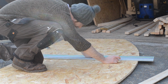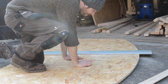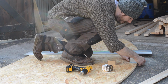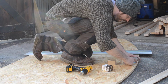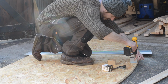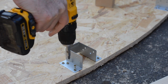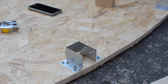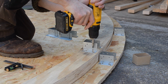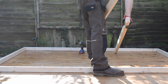I do try and think things through and work out what would be easier to do now before I actually build the walls. I decided one of those things would be to add these joist hangers while I've got everything on the floor, and it's easier to mark out where the centre point is. The first one goes on the ridge of the curve, and then I have one either side of that, evenly spaced. This then needs to be mirrored either side of my plywood curve and on the other end as well. In the next video you'll get a much better idea of how that's going to work.